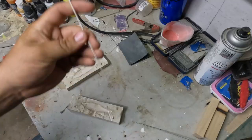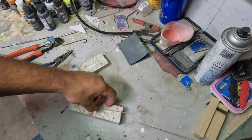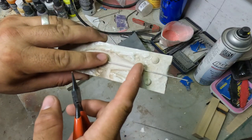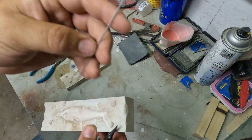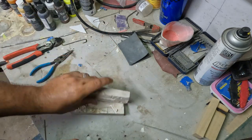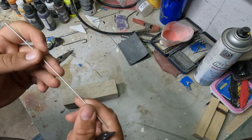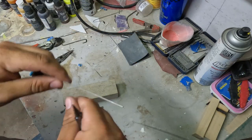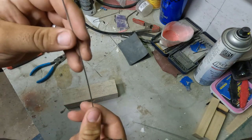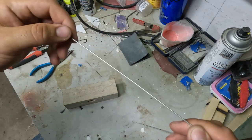So stay tuned. We have our little section of stainless wire here and I cut it so there's enough slack on both ends for me to double it back over, make the eye, and twist it. This is going to be super strong when it's done. The other thing this wire allows is when the spoon is straight, that's good for some applications, but other applications you want it to kind of swim. You can actually take that lead spoon and put a bend in it — this wire allows you to bend it all which way and it won't break. This is a through-wire spoon and it is extremely strong.